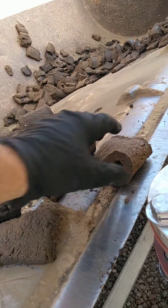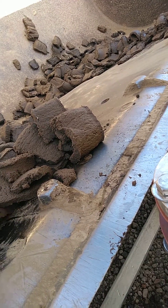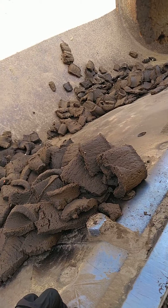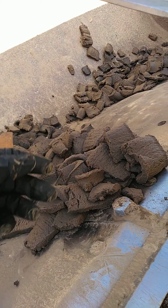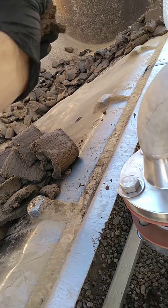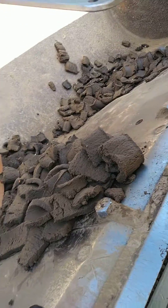20% solids. We're dealing with a sludge that was straight from the waste activated sludge basin, so we were dealing with 2,000 to 3,000 milligrams per liter of feed — extremely low feed — and getting around 18-20% solids on the discharge.